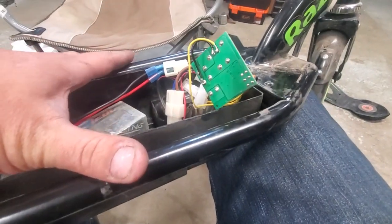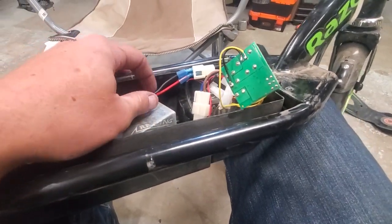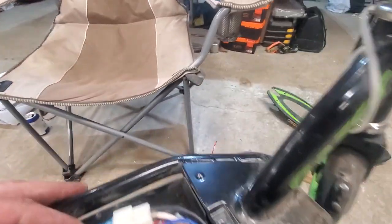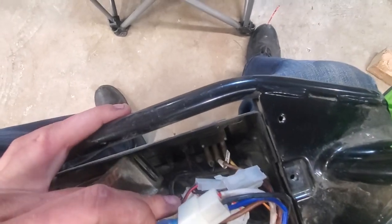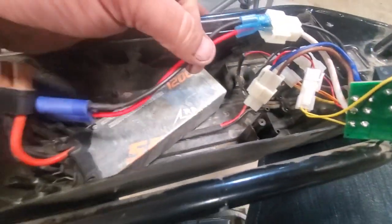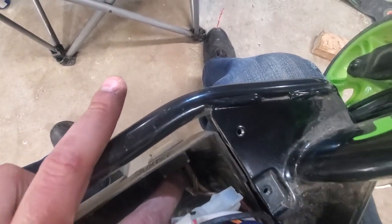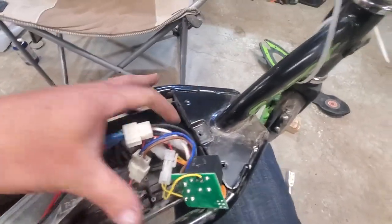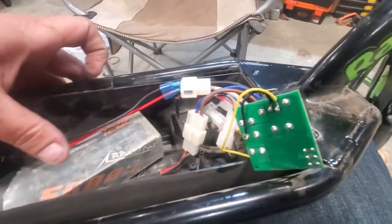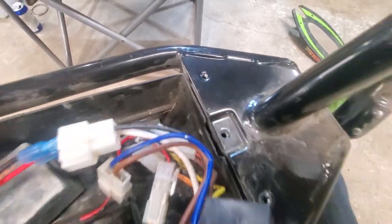Keep in mind, you will have no way of knowing what the voltage is on your battery. What I would strongly recommend is to add in a voltage meter. You could tie it into your switch — somewhere past the switch. Power comes from your battery, trace it down to your switch, and put a little voltage display on that. Do your research based on whatever battery you're running; you wouldn't want to run it below a certain voltage. That's the best way to monitor all this.